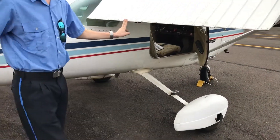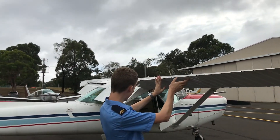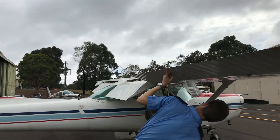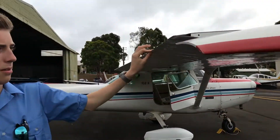Tyre's inflated, that looks fine. Same thing with the other aileron — nothing bad on top, nothing bad on bottom. It goes opposite to the other side as well. Look inside — four bolts, they're all screwed in. Now we can bring that back to neutral.